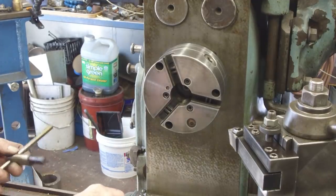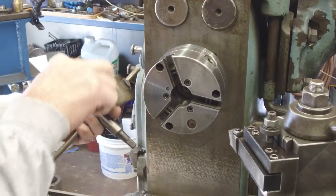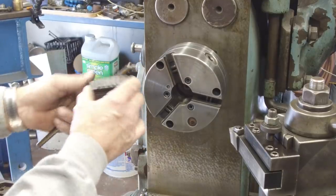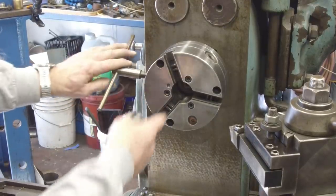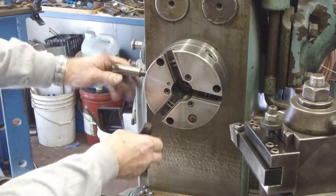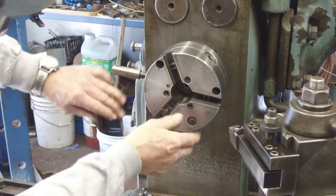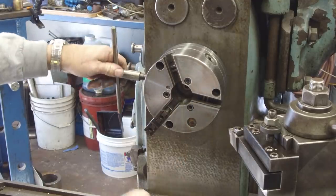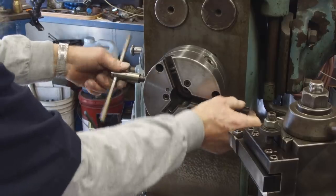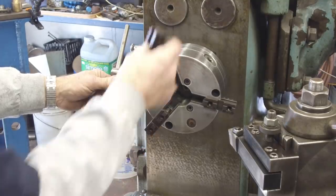Okay, I took my brush and brushed it. There's a light coat of grease in there and a light coat of grease on here. Sometimes you blow things off with the air and you're not getting it. The air's not going to lift that suction that grease has on there. All right, 3 and there's 1. So here's 1. We back it up until we see the start of the scroll. We push it in, make sure it grips, and then we watch the scroll come up here to 2. Same there. And our last one, number 3.